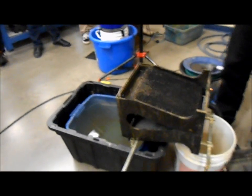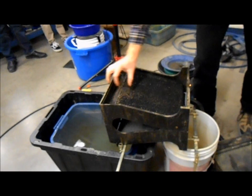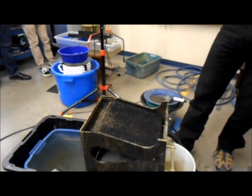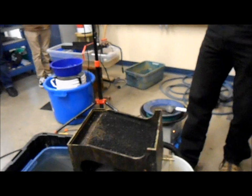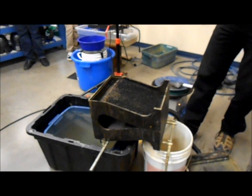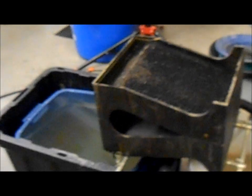Also, it creates a little bit of a trap here for anything that's really heavy, like nuggets. As the gold goes down into that trough, it shoots out over top, comes up for a little bit and then down onto the matting, creating a very, very low pressure area. The gold will mostly fall out right there because of that low pressure where that low volume of water is going by. Gold is heavy — it's going to drop down. Most of your gold will fall out right in that top two inches. When I ran from my hard rock mine and opened this up, that little section was a sheet of gold — almost an ounce worth of gold in that top little section.